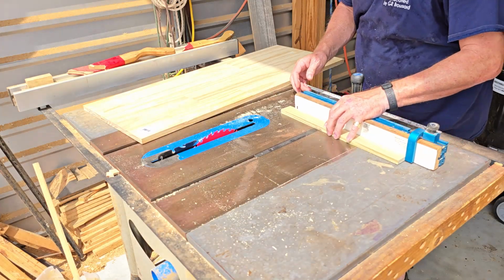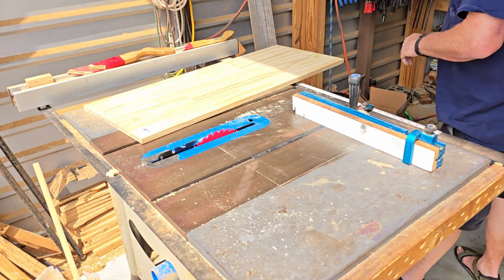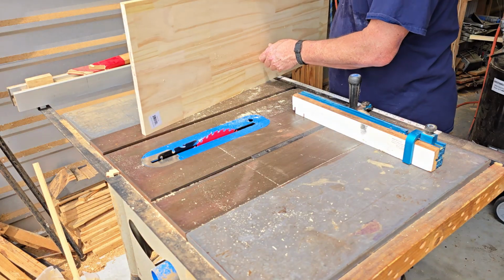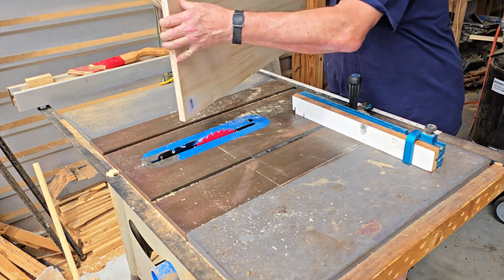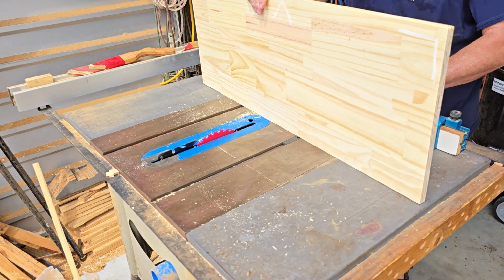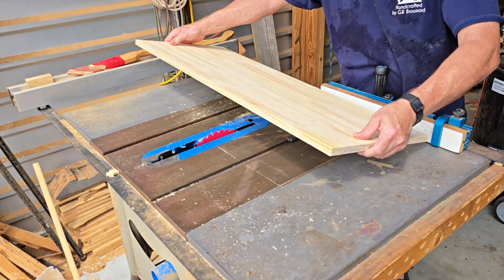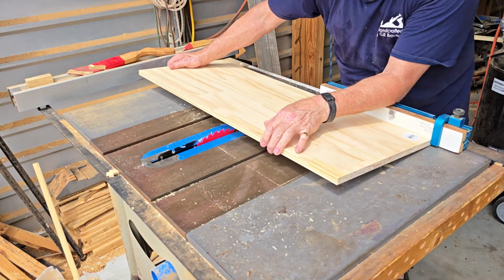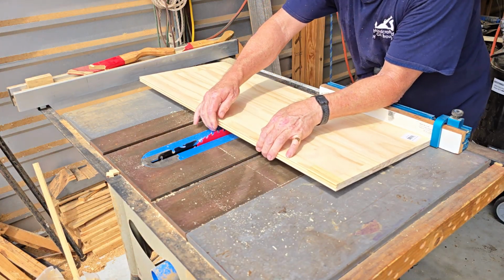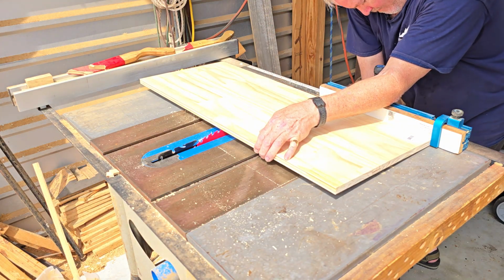This is my story stick, and it fits just right in there without hitting the teeth. So I'll have a little bit of play, and I can plane it down if I have to. I'm going to have to do a plunge cut on this because my table isn't big enough. And if I cut a profile, I always cut the profile side first because the teeth won't tear that out. It'll tear out the back of the shelf if there's any tear out.